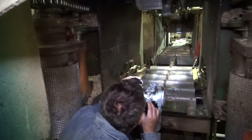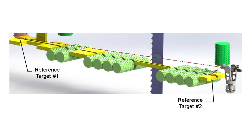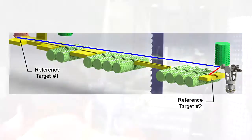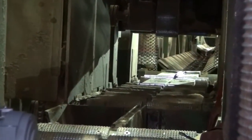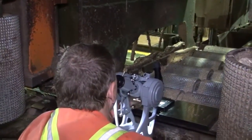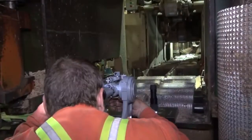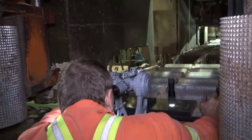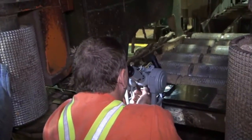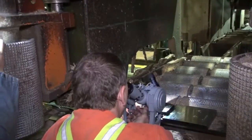Now the instrument is ready to be aligned to the reference points through a process known as bucking in. The jig transit is located on the outfeed end of the cutting section, where a technician can easily sight the keyway target blocks in their near and far positions. The operator sights and aligns the instrument to the far target block, then points the jig transit down and focuses on the near target, using the cross slide to set the telescope on the target block. This iteration is repeated until the instrument's line of sight passes through both targets with no adjustments, creating a vertical plane of symmetry that divides the machine center into equal halves. The buck-in is the final step in preparing the instrument to inspect and adjust the machine center.